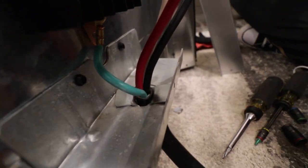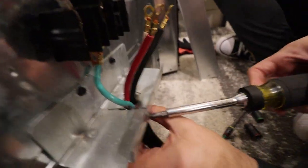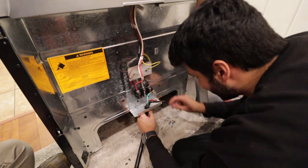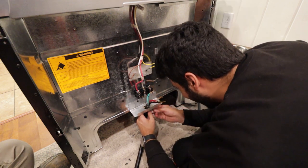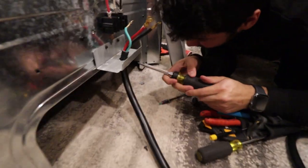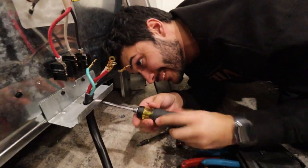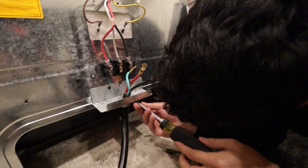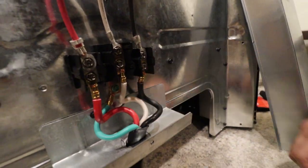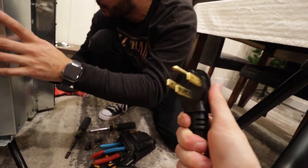So that connector was a little interesting. Sometimes the gloves come off because now it's personal. These connectors flip up into the hole versus a threaded lock-nut situation, which is what I'm used to on industrial work. Like, I've wired so many giant industrial things, and this house oven has a learning curve. You can take the whole plate off, put the connector in, make up the whole connection, and then reconnect it with the screws — that way you don't have to awkwardly position yourself. Look at that — beautiful. Well done, Jonah. Now we have our 240-volt 50-amp cord attached to our oven.